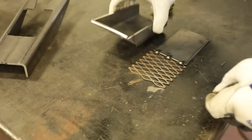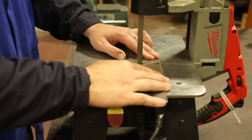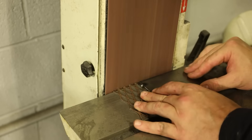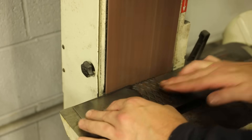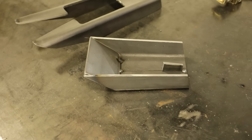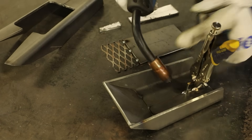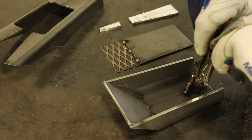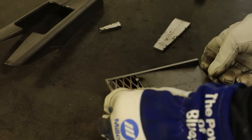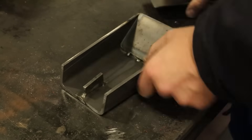I cut the shelf pattern from 1/8 inch steel as it seemed appropriate — it could be slightly thicker or thinner depending on what was laying around. This was then fit to the bottom of the stove. This shelf will be held in place by a piece of steel at the middle and some tacks on the side for support. The best thing about working with steel is how fast the glue dries. This shelf wants to be removable for easy cleaning of ashes and soot.